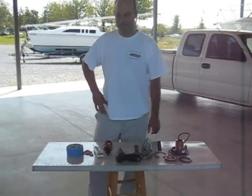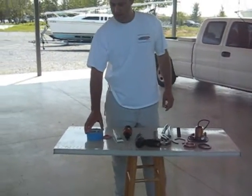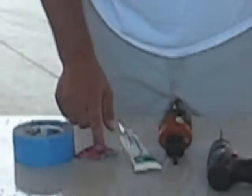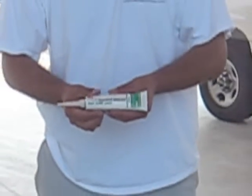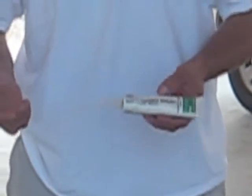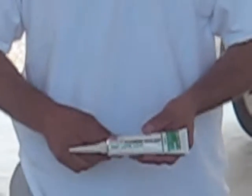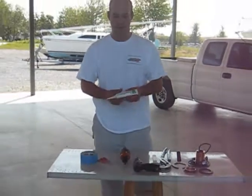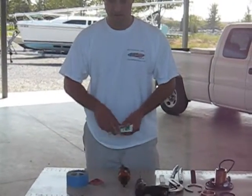The tools we're going to need are all laid out on this table. Starting on your left, we have tape — we use masking tape. You'll need some sandpaper. You'll need 3M 4200 fast cure sealant. Some people use 5200, but we use 4200. These transducers are not perfect, so they can fail — it's rare, but it can happen. So you're going to wish you'd used 4200 if that happens.